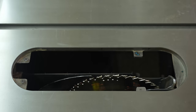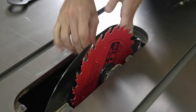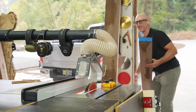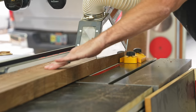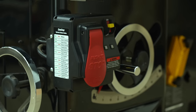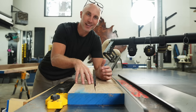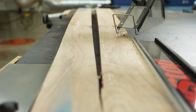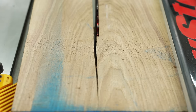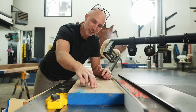I probably should have involved her in the design process, but I went ahead and bought about $950 of very straight-grain walnut. Now I need to rip it into straight planks. One thing to be aware of when ripping thick stock is how much internal stress there is in some wood. Even though this wood is properly kiln-dried and I was cutting perfectly straight, there was so much stress it actually cracked all the way through — pretty common for walnut.